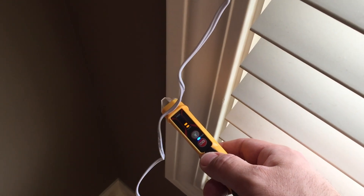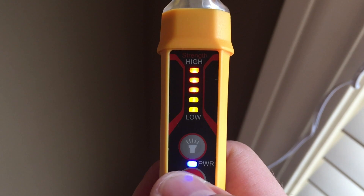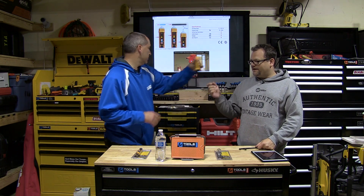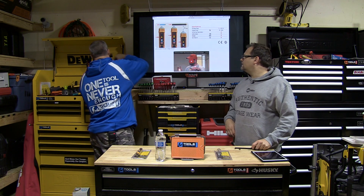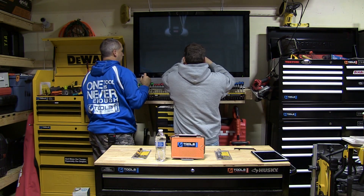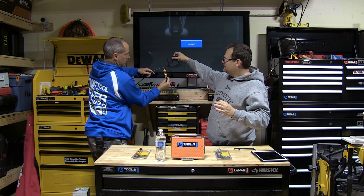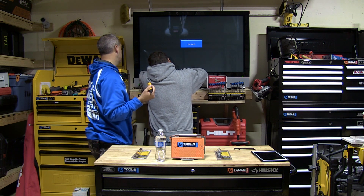It's starting to turn orange. Check out this demo — it's picking up on the Apple TV power cord, non-contact, and it detects it from a relatively far distance. Keep in mind it won't work through shielded conduit — if it's shielded by steel, it's not going to pick it up. But look at that bar graph going, detecting everything right there — nice job!